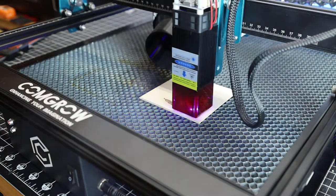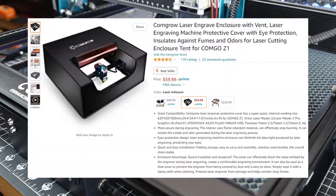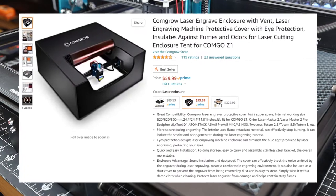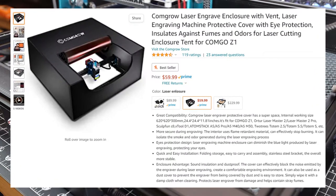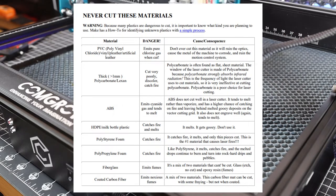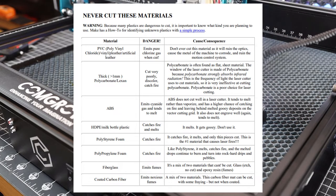It's making a ton of smoke, and depending on the material you're using, it could be very toxic. I really suggest getting an enclosure for this type of machine, seeing that you can get them relatively cheap and it will protect everyone in the room. Also, be very careful what you're cutting and engraving on. Like PVC will emit chlorine gas if you cut it, which can kill you. And I'll make sure to link to all the materials you can and can't use in the description below, or you could just take a screenshot of that little list.